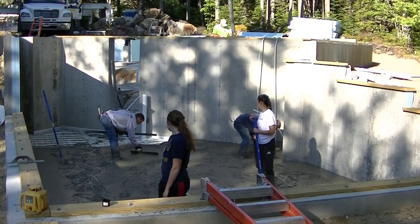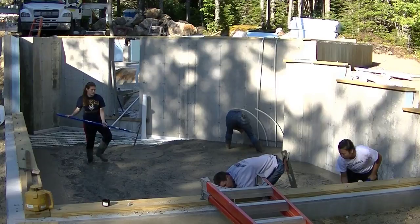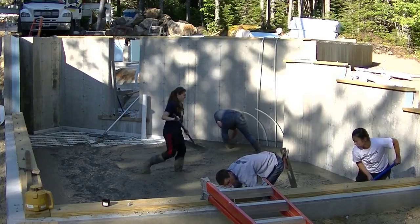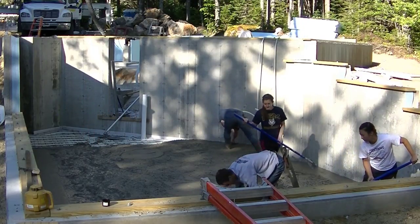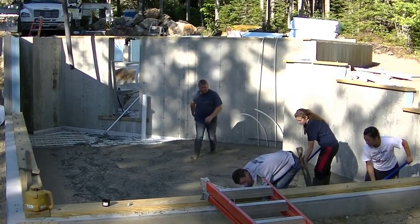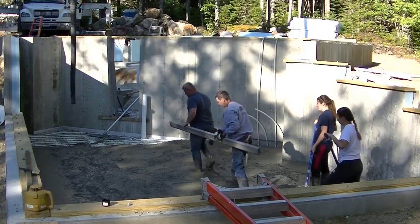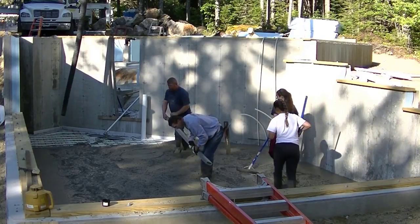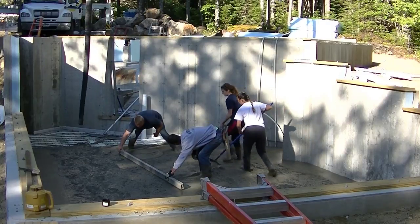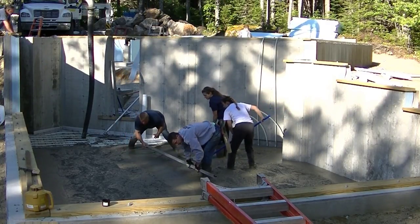You see, I'm making another wet pad there. Getting ready to straight edge this thing. Shooting grades with that laser is really easy. That thing's really accurate. I'm striking the pad myself while Luke's finishing up magging. He's going to grab an end, then we'll finish that pad, then you'll see a straight edge in here.